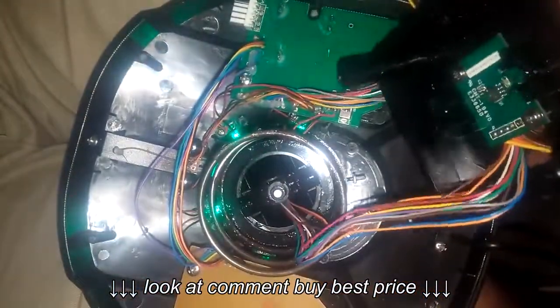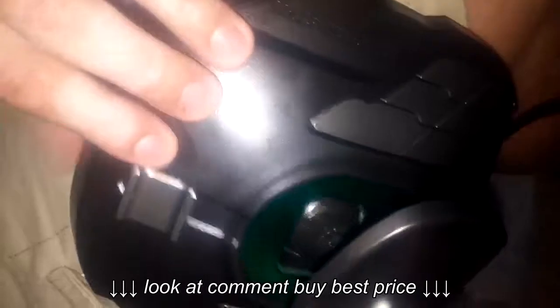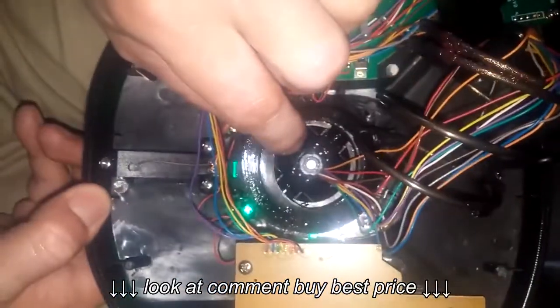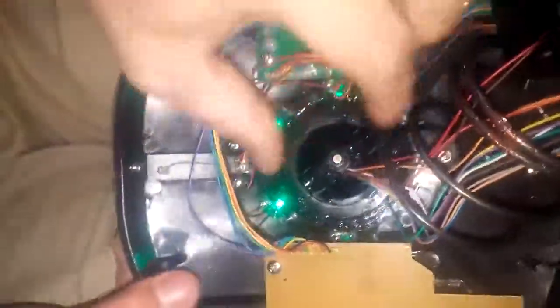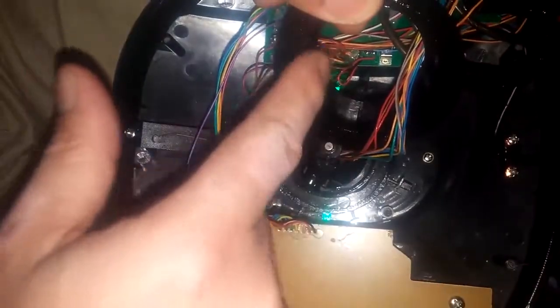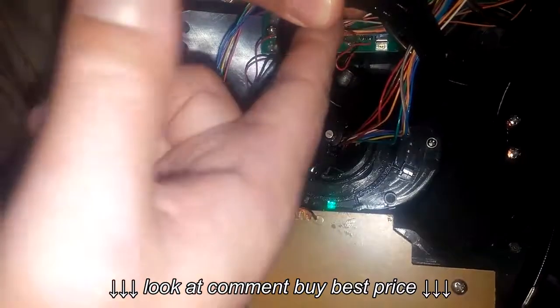Avoid these wires because they go straight to the stick. The part you want to grease — many people think you put your grease here, which is necessary, but that's not the main place. This is the most important part over here: when you move your stick it actually presses against this ring, and the friction occurs on the inside of this lip where it pushes against the stick.